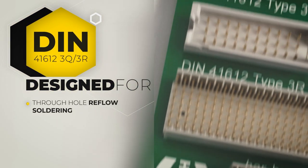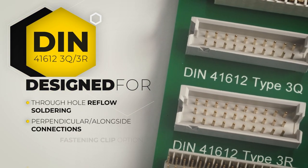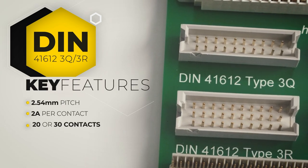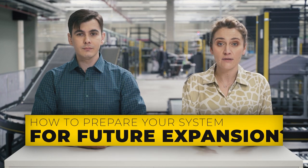To accommodate the needs of the industry for miniaturization, Harting designed and developed the 3Q-3R. It is robust as the full package but only a third of its size. It is designed for through-hole reflow soldering and perpendicular or alongside connections of two circuit boards. It counts with 20 or 30 contacts, is available with or without a fastening clip, has a 2.54 mm pitch, and each contact can take up to 2 amperes. It is compatible with 3B, 3C, 3Q and 3R types.